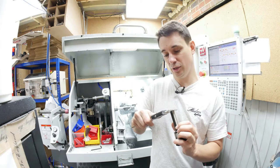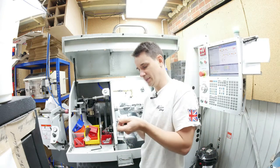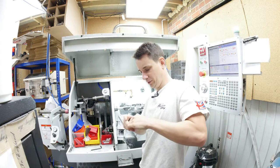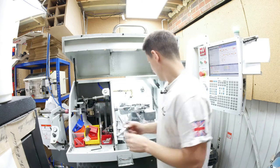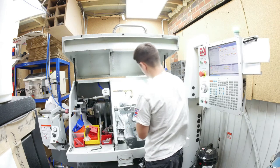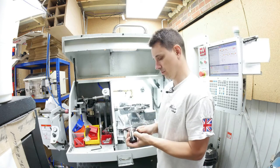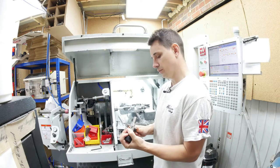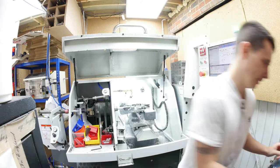The shaft on this is 15.96mm. The drill that goes through is 16mm and the hole size is 16.04 at the front, 16.01 at the back. That shouldn't be a problem since it's nice and tight — it's just not going in. That tells me it's got some sort of edge on it; not surprised, it's a Chinese thing. The measurements read 15.99, 15.98 — I really want to make that fit properly because this is how you center everything up. Oh, look, it's gone on in the end. So that's our sleeve.